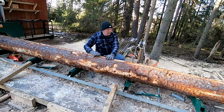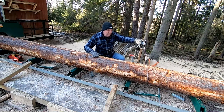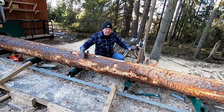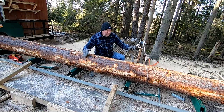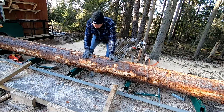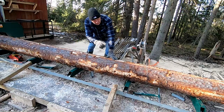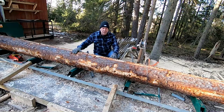And as you notice, I still got the winch with the wire attached and it's locked. So when I walk around out here and spin the logs, I keep this one on for safety reasons if it starts to roll when I'm walking here. And I keep this on until I have secured the log, just a safety precaution.